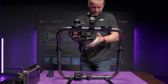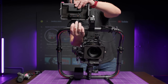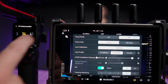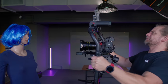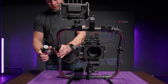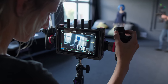In a more professional setup you always have a larger battery somewhere, but in a handheld situation you need an extra large battery. In my opinion the best solution here is the Ring Grip from Tilta, which has a special V-mount plate for extra large batteries, and thanks to additional power output connectors you can power not only the gimbal but also the camera, monitor, light — you can basically expand the set as you wish. Setup in this case looks almost identical to the handheld camera, but you need to attach an extra USB-C cable to communicate with the RS3, and that's it — you are ready to shoot. You can use such a setup as a solo operator as well as with a focus puller.